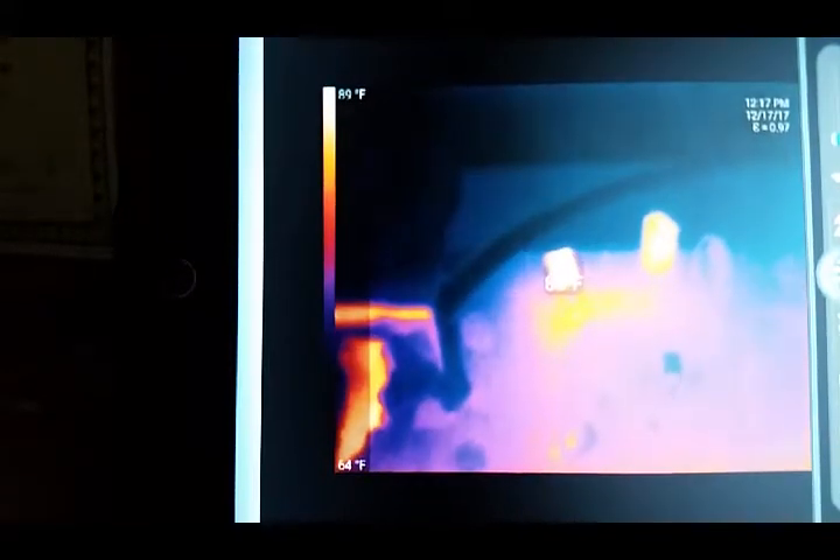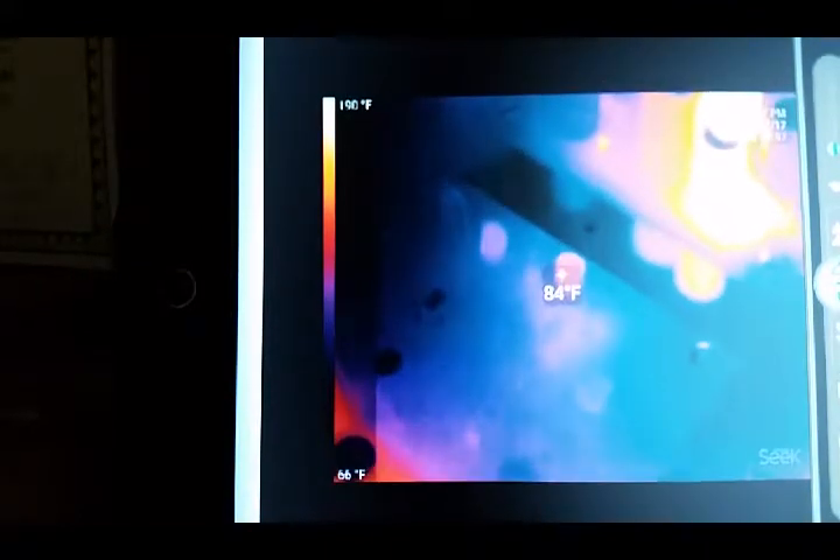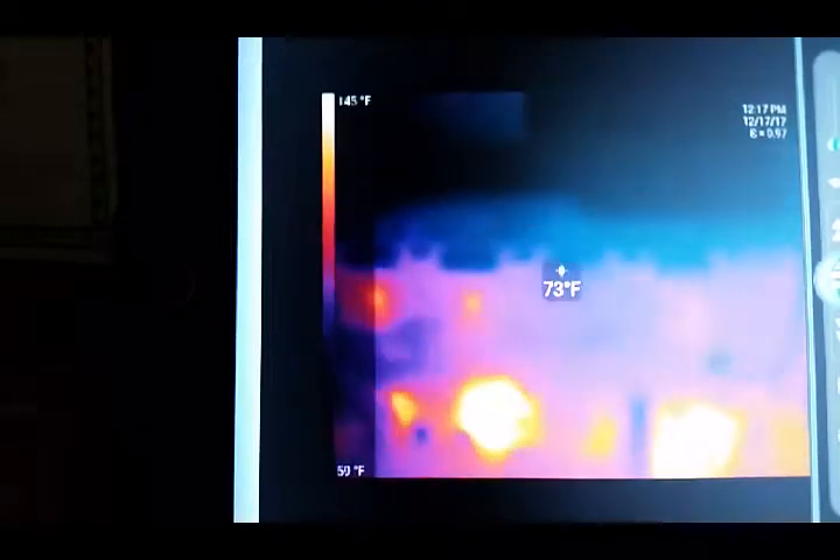This next one is going to be about 88 degrees, and these are part of the left channel — the channel that's functioning correctly. This one's part of the right channel and it seems to be faring okay, sitting at 84. Getting an overview of the whole amp: the two on the left, the left channel, is working fine with transistors mounted to the heat sink. On the right-hand side, the farthest right transistor is actually trying to work — it's fine — but there's another one there that you can't see at all, and it's not working at all.